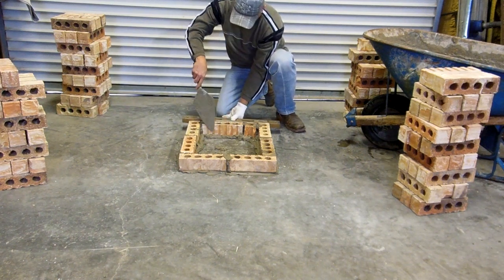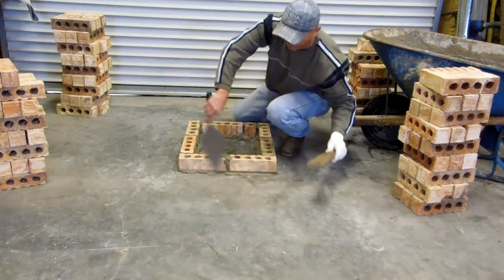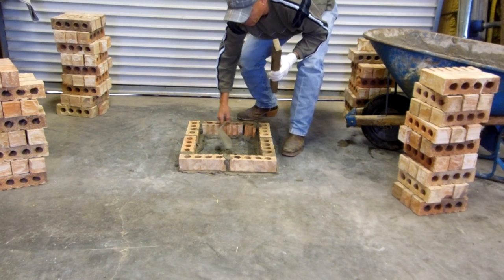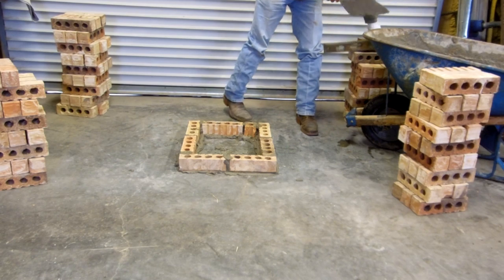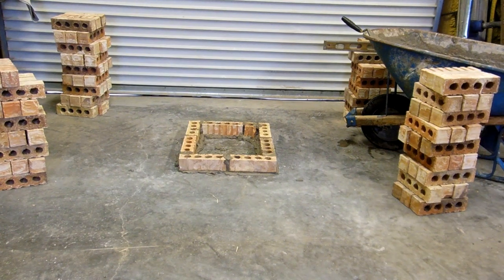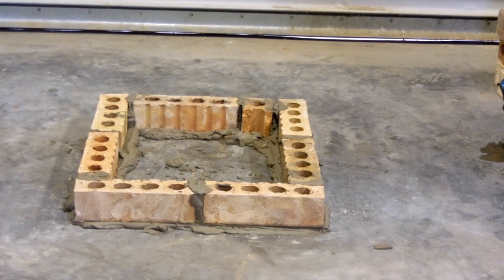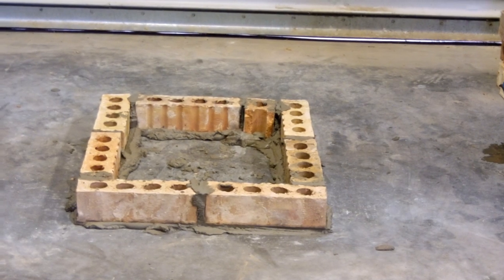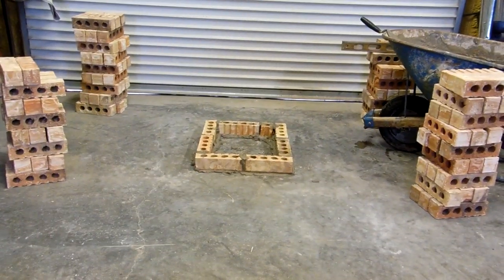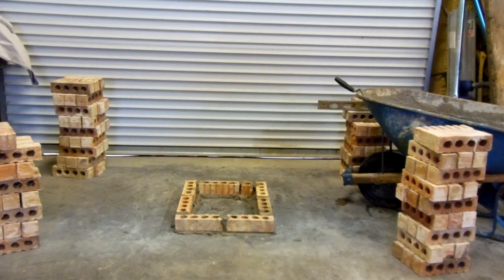Since you're straightening your line, just go around the outside edge. Straighten all the brick. You should pull your head joints, but we don't want to leave any of this mortar down inside here. It doesn't even need to be there. Now, this is just two brick wide, two brick and a bat in depth. And we're just going to go straight up with it.